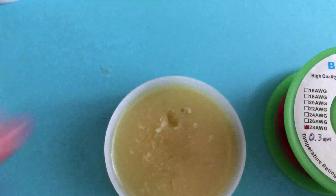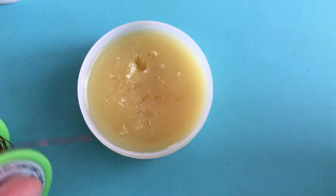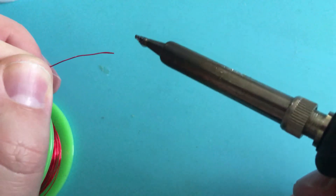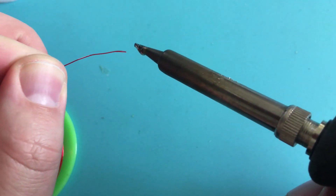It's a problem. The next thing I'm going to do — I've got this little bit of flux wax here. What I like to do, you can kind of see I've mutilated it — I just like to dip the tip of whatever I'm tinning in there. You can never have too much flux unless you do, but you probably don't. The flux is on there and it just helps keep things clean. I'm going to insert this in as far as I want the enamel stripped for just about two seconds — insert it in, let's say a couple millimeters, one, two, pull it out. Look at that — it is perfect. I'm going to put it a little further so you can see just how perfect it is. Now the enamel is actually burning off. You can see just how perfect that tin is — it is beautiful.